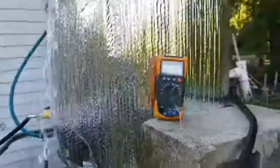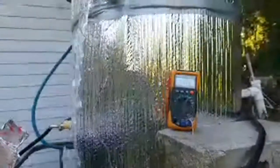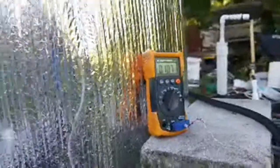Now, of course, you're not going to burn your hand putting it under there, not at 109. Now it's at 108. So we're very close to the temperature that we used to get without turning on the cold water. It jumps up to 109. 108. And this is holding up pretty well. After it was a huge rainstorm last night, and I don't see evidence of water having gotten in. Okay, we're at 107 now. That's an indication that we need to now turn up the cold water.